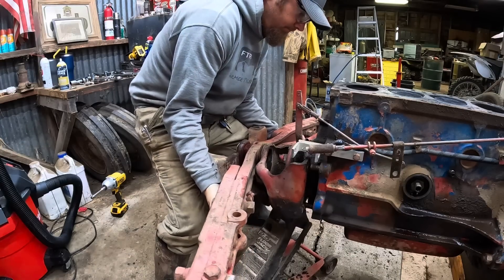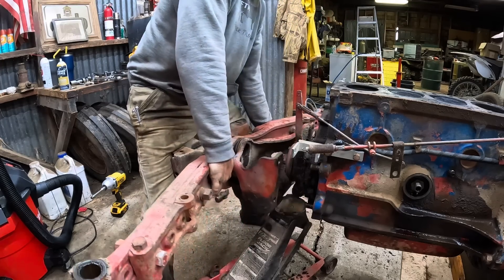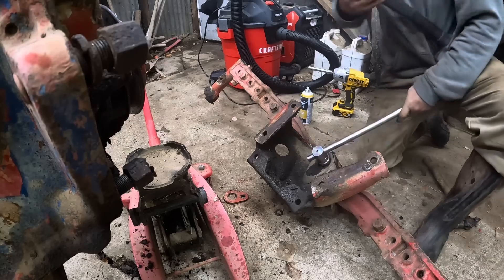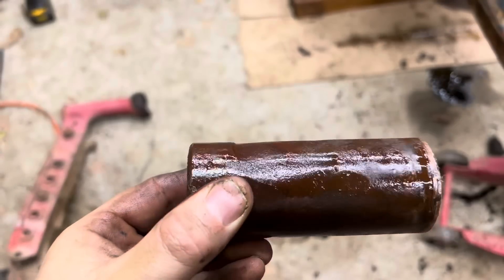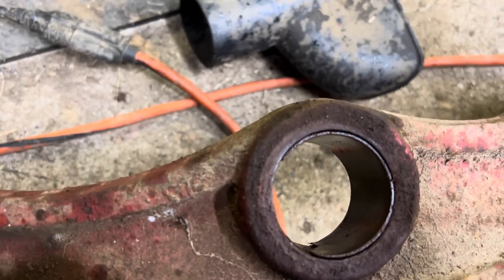The jack's got it — it's not terribly heavy. Finally was able to get this thing broken apart, and now that I can see what was in there it's no wonder the axle was moving so much. If you look at the pin here, you can see it's got a big flat spot in it — that's just from wear, bouncing around through the field. The bushing that's actually in the axle — only about half of it's left and it's very thin. Hopefully when the new parts go in there it'll really make this a lot more solid.